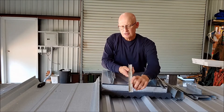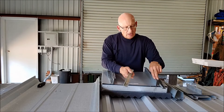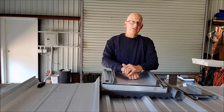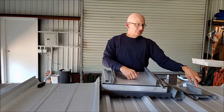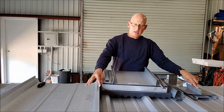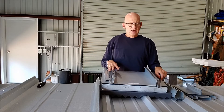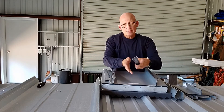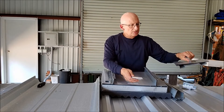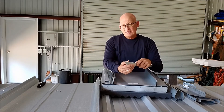The panel goes down into the clips, and then we have a separate seam cap that we manufacture. The cap has two beads of sealant that sit right on top of the panel rib, so there's no interruption between the panel clip and the sealant. With the other panel types, there's always a place for the roof to leak where the clip interrupts the sealant — but with this panel, the clip never comes in contact with the sealant. The seamer takes the cap shape and folds it — it's very simple, not a complete double lock seam, so you won't have seamer problems.